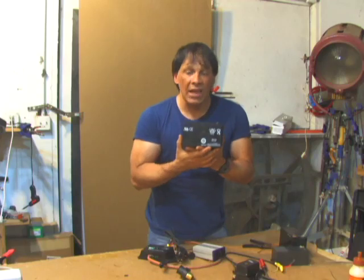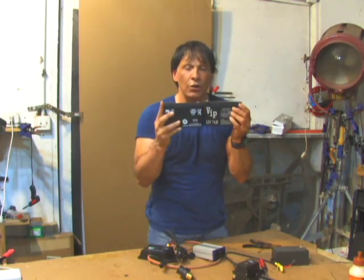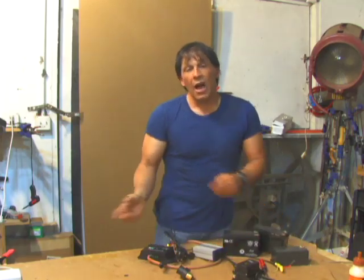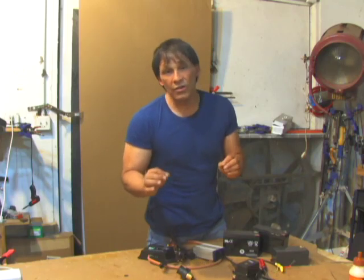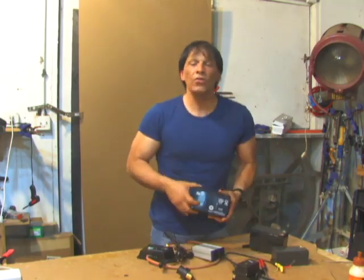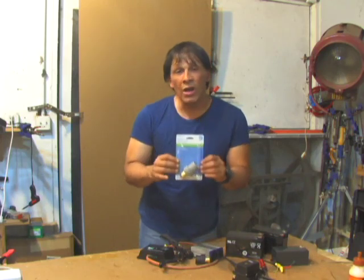So we're talking about taking a 10 watt LED bulb and running it for seven hours. If you need more power, you can take two 7 amp hour batteries, put them in parallel, charge and discharge them simultaneously, and you end up with 14 amp hours. I'm using a 40 watt panel, so in theory it has the capability of producing 400 watt hours throughout a 10 hour day — realistically around 300 to 320. So we could run three 10 watt light bulbs for 10 hours. That's where the photo cell comes in for our standalone system — it'll turn on at dusk and off at dawn.